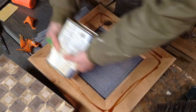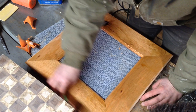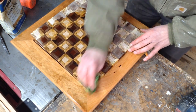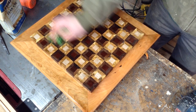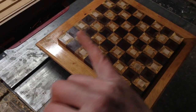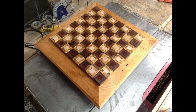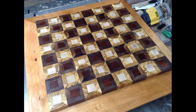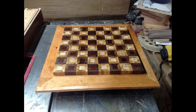I went through with the sander and just sanded down that epoxy. For the finish — I'm not going to show the whole thing — but I'm finishing it with teak oil and then once the teak oil dries I'll put a clear coat on it. I usually put four or five coats of teak oil on and in the winter time it takes about five days to do that, then it has to dry for at least 72 hours before I can clear coat it. So this won't be done for at least another week, but with it freshly teak-oiled that's basically what it's going to look like. The way he finishes his boards is he puts a little washer in the corner and some dabs of adhesive on the bottom of the board, and that's how everything is held in place. There will be a little shadow edge around the entire perimeter. I wanted the frame to be big enough that if you wanted to play while putting your pieces on the side you could, but you didn't have to — and this is basically the finished board.